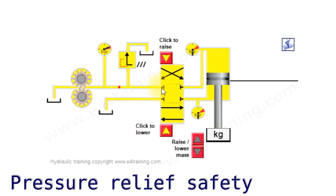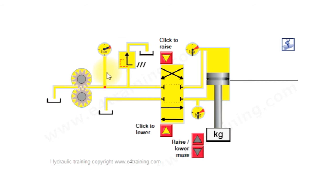The valve is closed, shown by this symbol, so the fluid needs to go over our safety pressure relief valve. If it didn't go out somewhere, the pump would obviously fail. It's a simple circuit — you wouldn't really want all your flow going across a relief valve because you've got maximum pressure and it would be very wasteful.